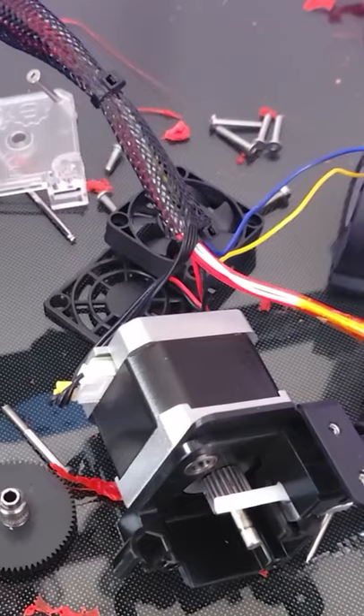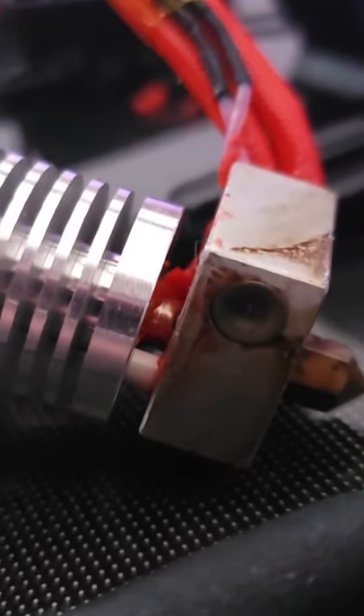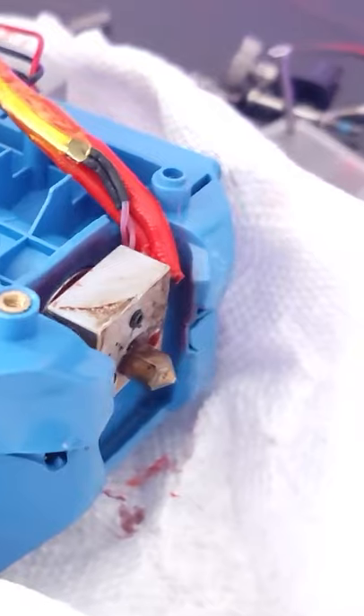This PLA was not coming off. I spent the rest of the day disassembling my extruder. I replaced the Bowden tube and carefully cleaned out as much PLA as possible while heated, then reassembled it and ordered a replacement just in case.